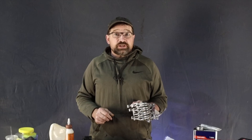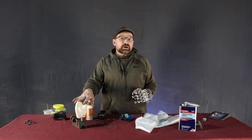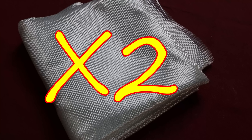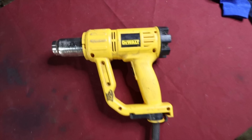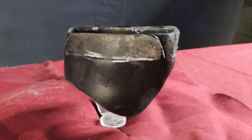For full transparency, this will actually be the third shell I've pulled off this buck. I had some issues with the first one because I was using slightly out-of-date resin. The shop was about 50 degrees and I was using 12 drops of catalyst per one ounce of resin. This should have been enough, but the construction — seven layers thick, sock, two layers of fiberglass, sock, two layers of fiberglass — did eventually kick, but not until after I added some heat to the setup. Overall it came out okay and I think I'll be using that one for the rest of the build.